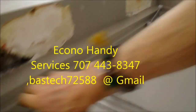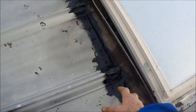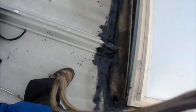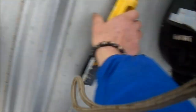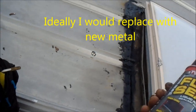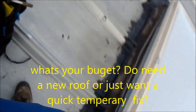There's a leak here somewhere — you can see the corrosion. So for the roof repair, these end parts were really rusty, so I put this fabric over it. I actually tarred it at one point with Henry's roofing patch, and then I went over it with this fabric stuff to make sure all the screws were sealed up, then put a couple coats of this sealant on it.